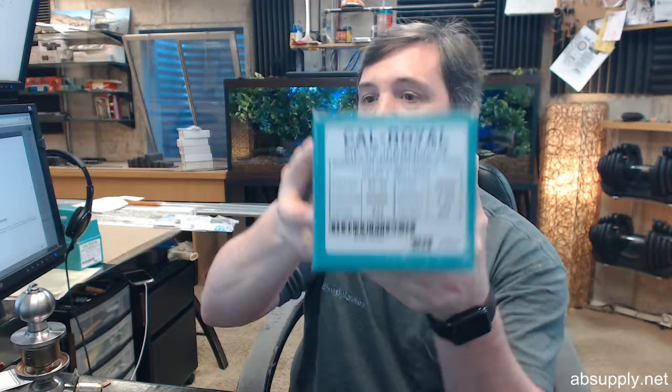This video is to bring you a closer look at the Cal Royal, part number BA00. The BA is a member of Cal Royal's Grade 2 cylindrical knob locks. It's called the Barrington series. This lock happens to be the OO function, which is an entrance, in a 32D satin stainless steel finish. Let's go over it. I have one removed from the box. I'd like to go through it with you now.